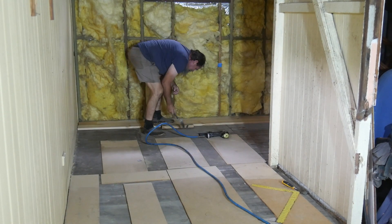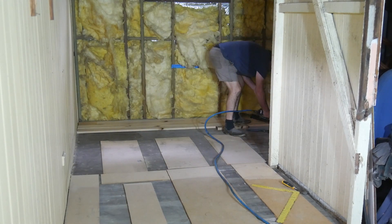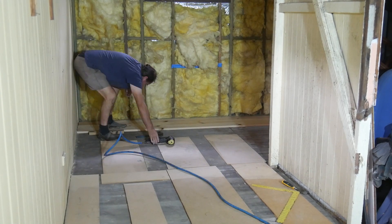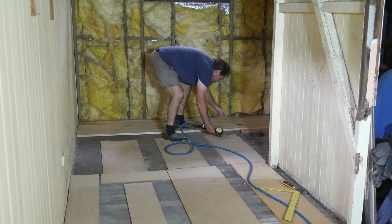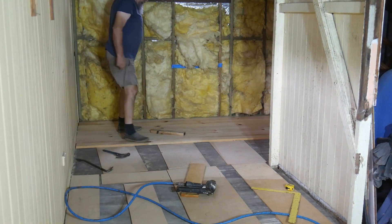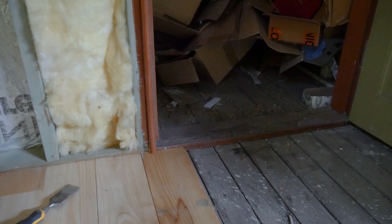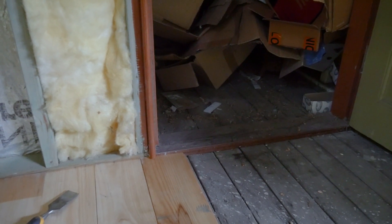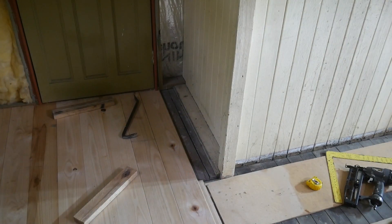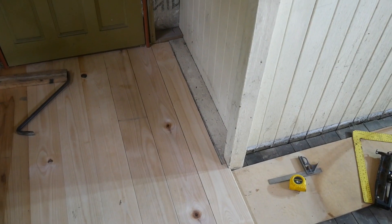As we go, we need to tap the board firmly against the previous board to keep the gap between them to a minimum. We stand on the board with our left foot to keep it in place. I'm cutting these boards as I go from lengths around the 4 metre mark. We've got past halfway — 7 boards in — and we've come across a doorway which leads onto the front veranda, currently used for storage. The floorboards fit into a purpose-made groove in the hardwood step. We've got up to board number 12, but board 13 needs to be shaped into that corner, requiring a bit of accurate woodwork.